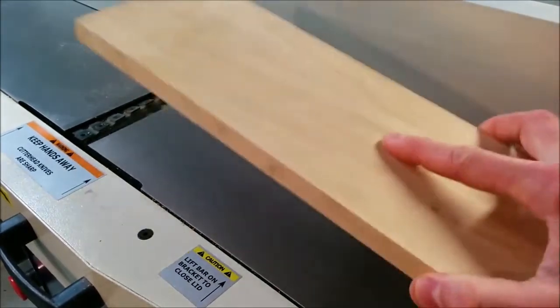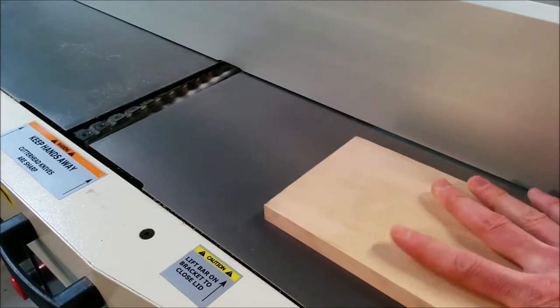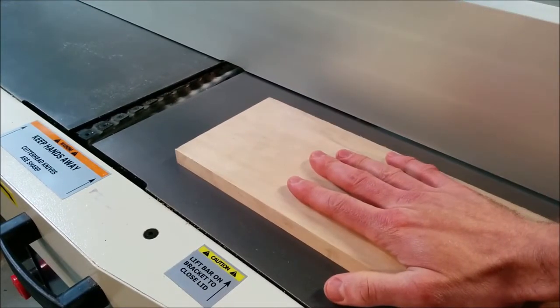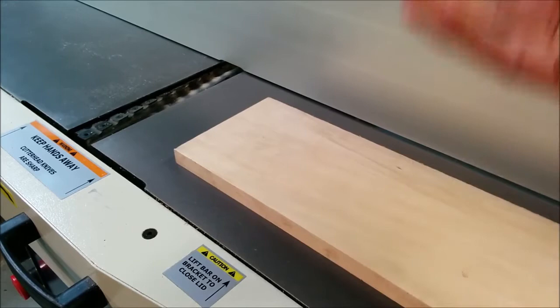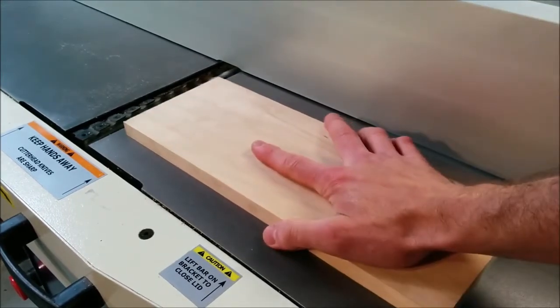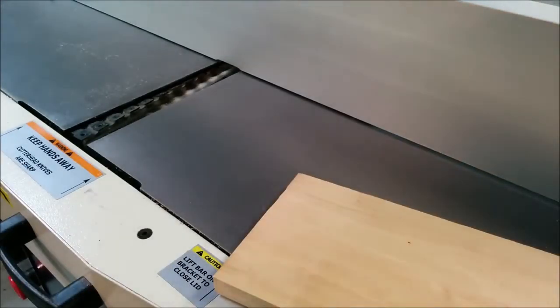as good. I took this same piece of wood and I ran it across this surface as well as my polished bandsaw table, and it was easier to move the wood on the polished surface. So I give RIKON a C for this table surface. I would like to see it be polished. Next, we can talk about the cutter head.